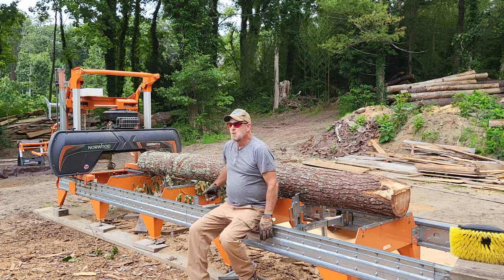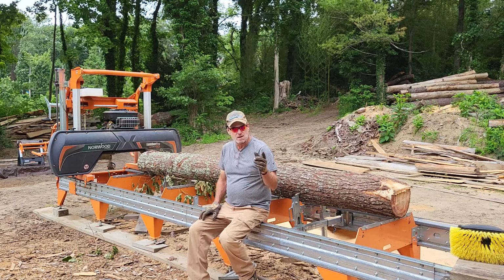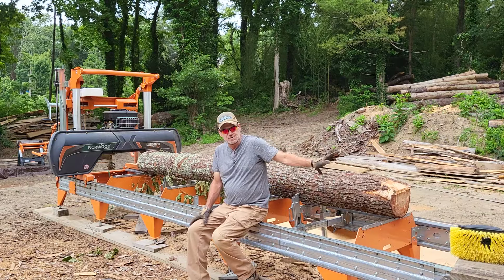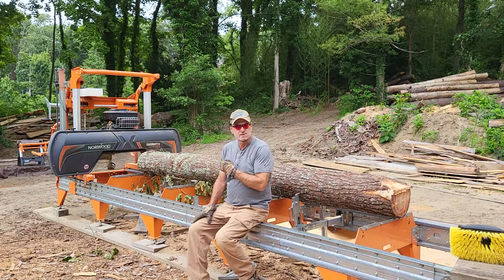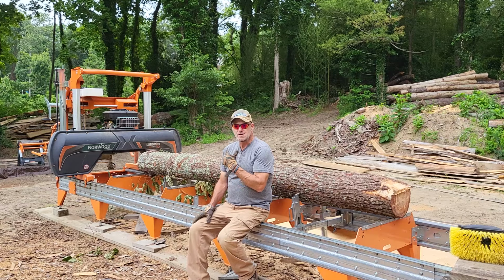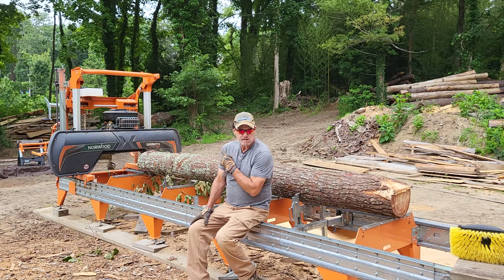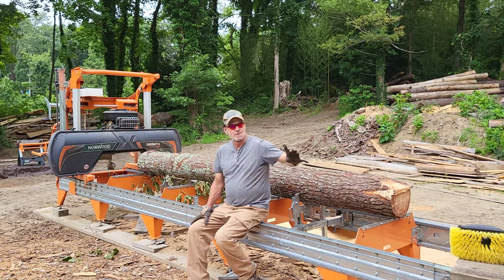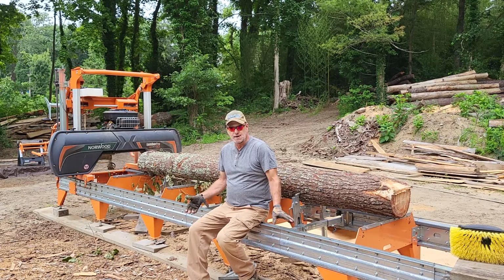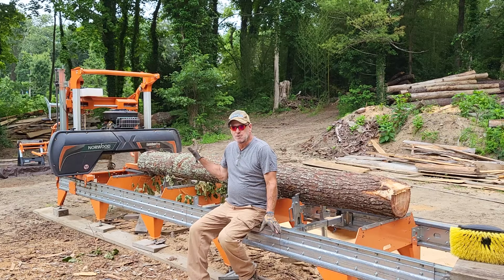So we're going to mill this one off. I'm going to come over and take a quick look. Actually, I'm going to move you guys because you're going to view from over there so you can see the outfeed side. I think this clutch is starting to go, and I have a heavy-duty clutch inside. Let's just hope it holds on. But you're going to be able to see the outflow side of the sawdust and see me mill the whole thing. I'm going to go at it pretty hard. I've got my mics on, so that messes with the noise of the mill.